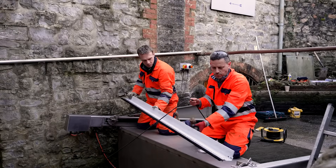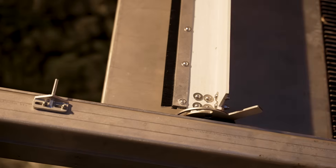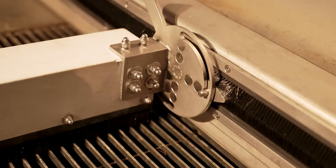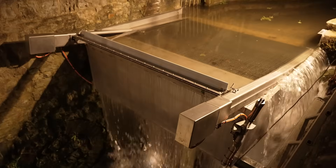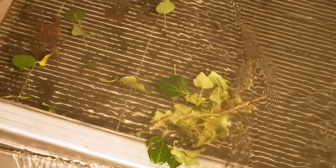The main difference between the screen scraper and the GoFlo traveling screen is the size of the intake. The screen scraper is made for smaller intakes, and it's ideal for a very shallow angle screen like it is here. It uses a wiper mechanism to actually pull the debris off the screen. The pulling force is very slow but very powerful — it's mechanically flipped and then holds position using super strong permanent magnets, so it can do its return path without pushing all the debris back down to the bottom.